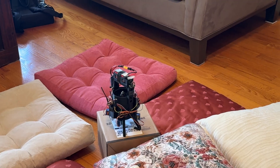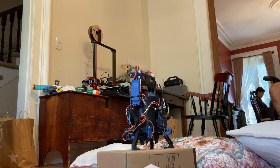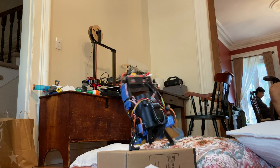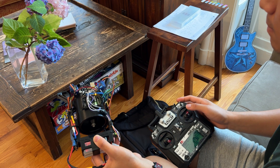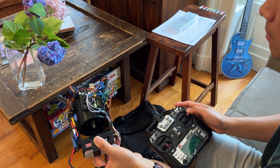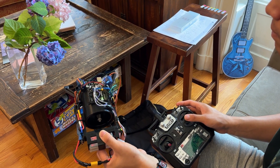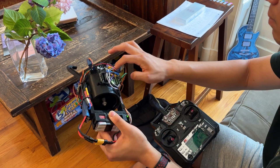Additionally, it took a lot of throttle to get this thing moving. With these two things, it's pretty obvious that there's a balancing and thrust issue that matters a lot more than the actual thrust vector right now, because it's preventing me from even getting in the air and observing the controls in the first place. You can see with this very scientific flower test that the thrust vanes do actually move the air — I'm manually controlling the servos with my FlySky TX and blowing on these flowers to show that the air moves based on servo movement.